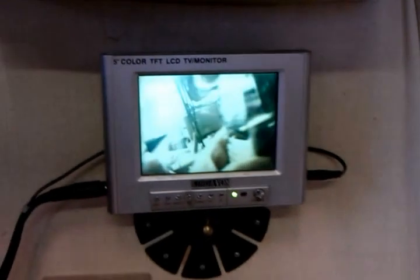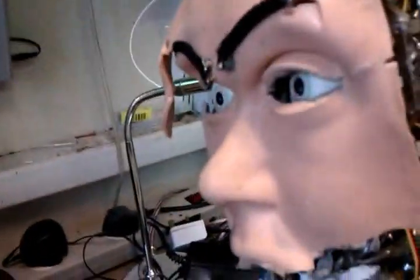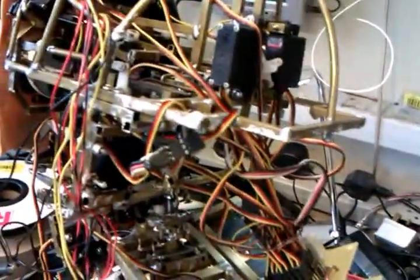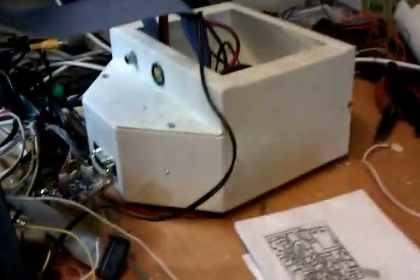Okay. Right, and now we're back where we started with the two images in sync. It probably takes maybe up to 20 seconds. It depends how far out of phase the two images are as to how long it takes, but it could take quite a few seconds to align itself. But once it's done, because I'm using the same crystal rather than two separate cameras with their own crystals, which will always be slightly out and you'll have to re-sync every so often, it's much better obviously to do it this way and have a common crystal and a common clock to both sides.